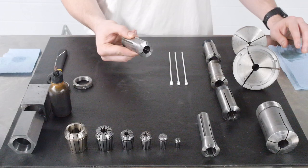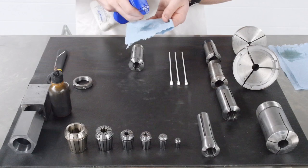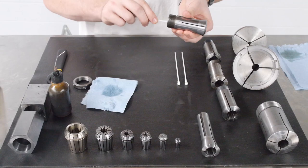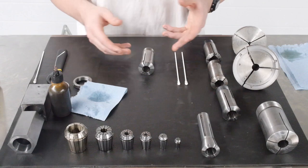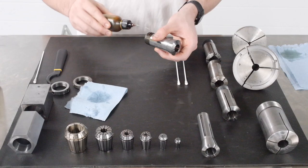Finally, we're going to talk about proper collet care. Before you use a collet, you want to make sure it's fit for use. First, clean it off — get rid of any excess debris or oil. You can use some WD-40, spray a little bit onto a blue shop towel, and wipe down the collet: the outside, the threads, and the inside. You can also use a Q-tip to reach hard-to-reach places like the inside of the threads or the middle of the bore. After that, provide some lubrication to the threads to make sure they're not going to seize when you put it in the fixture, like the collet block or collet chuck. If they were to seize, it would make it really hard to extract the collet and could damage the collet chuck, collet block, or the collet itself. Apply oil to the threads and, using a Q-tip, spread it around to ensure adequate lubrication — any type of lubrication can work, oil or grease.